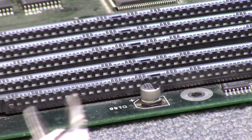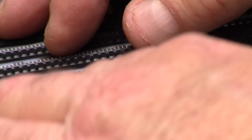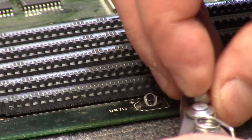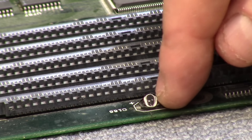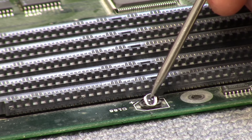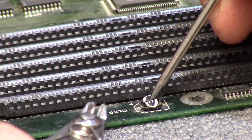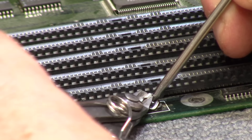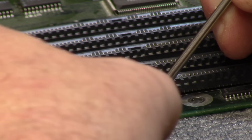I have a pair of snips — I call them Lorena. Lorena Bobbitt. Cut this cap off in a single pass. I press my finger on it and I snip it in half. You're left with a ring — a ring of aluminum around the cap, a rubber gasket, and two nipples. I do a relief cut. I snip the cap on its side — snip — and I then peel this ring off. Bend it, do what you got to do to peel this ring off.